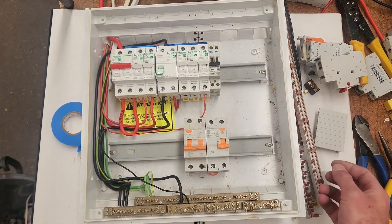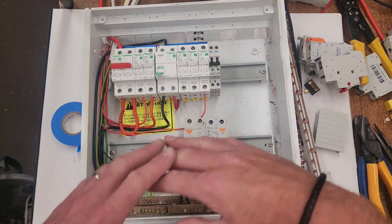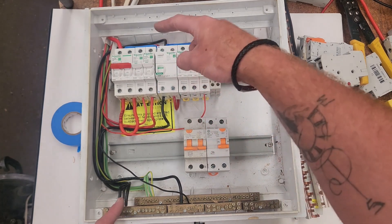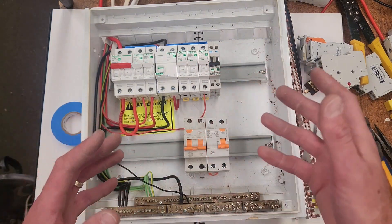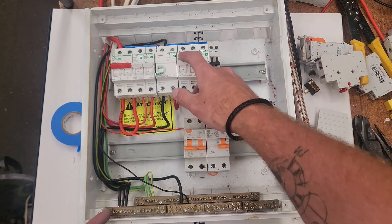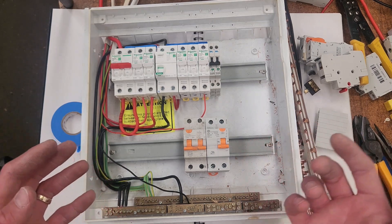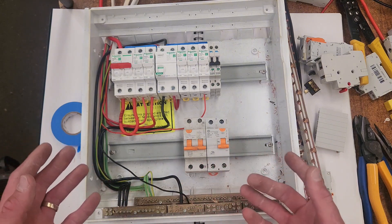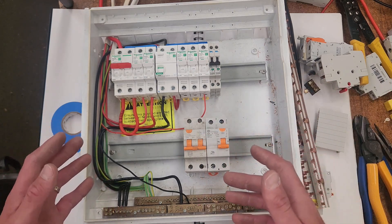Lastly, with stickers and labels on the outside of your board, the regs do call for more than just 'power' and 'lights.' I generally put power and lights on the bottom with the RCD, then on the top I'd say something like 'lounge' — so you'd know it's lounge lights or lounge power. It gives the customer a much better understanding of what MCBs and circuit breakers control what in their house rather than just guessing. You've seen me use a whole bunch of different tools and there's no single right way, but I hope you've learned something. Hit me up in the comments if you've got any questions — thanks for watching and follow for more from an NZ Tradie.